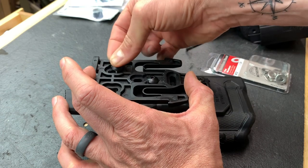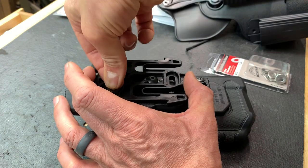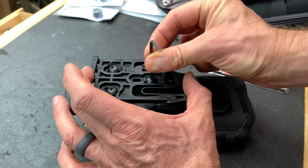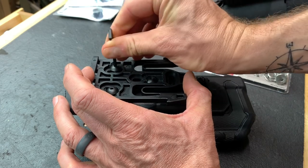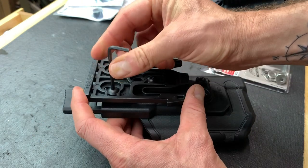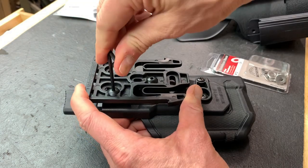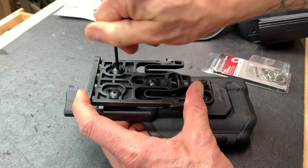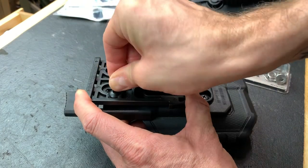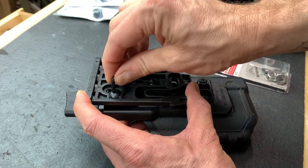It can be a little fiddly lining up the screws with the washers. Safariland was nice enough to include an Allen key of the appropriate size. A good tip: once you think you're lined up, back the screw off until you feel a click, then go forward — that keeps you from stripping out the brass inserts with the steel screws. Snug it down, but don't go too tight or you can damage those brass inserts.